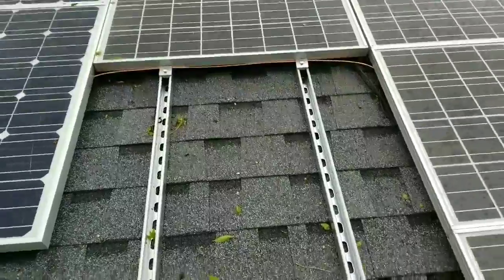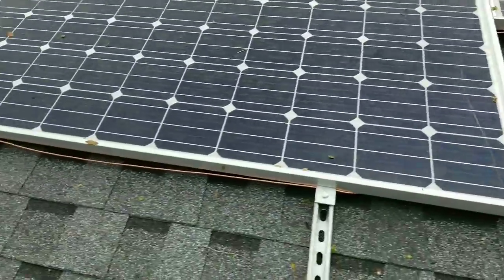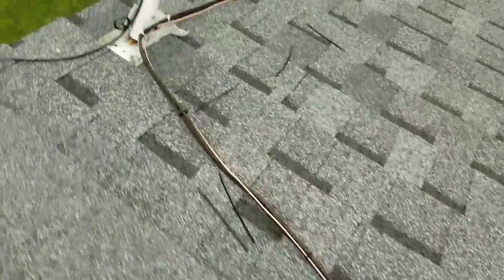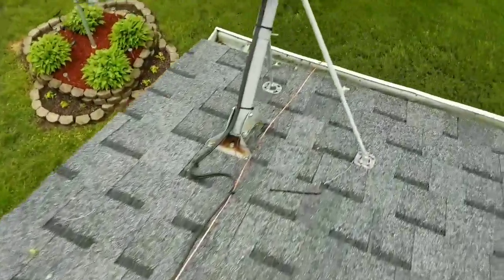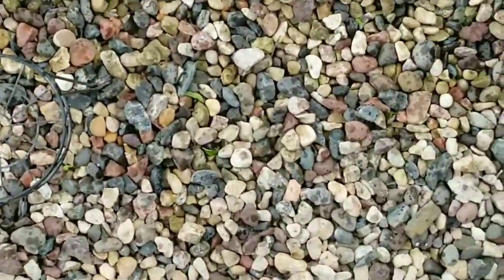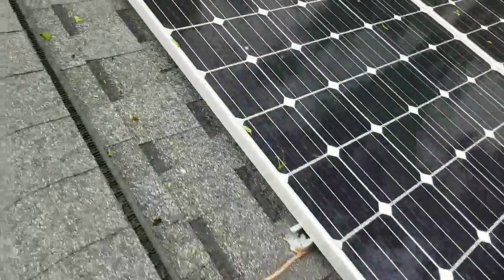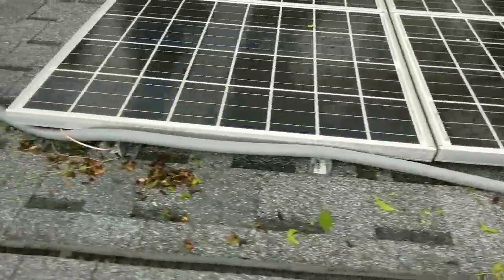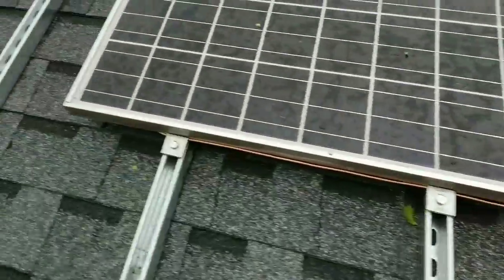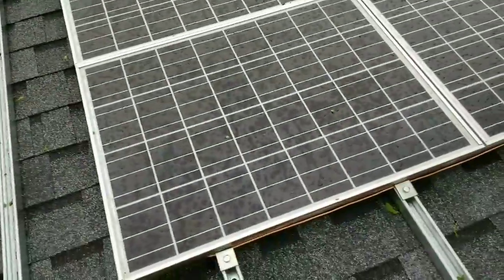It's kind of raining right now so I'm going to be off the roof. All the grounding is done right there. Panels are all grounded, all the way back — you can see them by the satellite dish, all the way down to the ground rod over there. I'm walking fast because it started raining and I don't want to be out on the roof. Everything is all grounded — all the rails and all the panels attached to the rails are grounded.